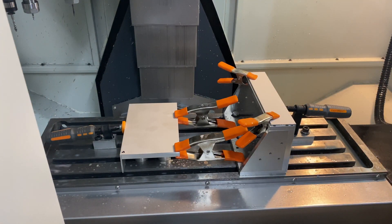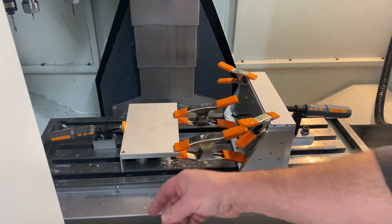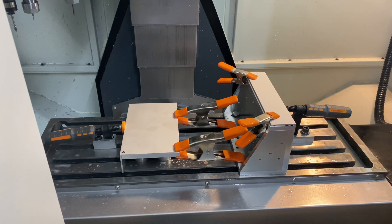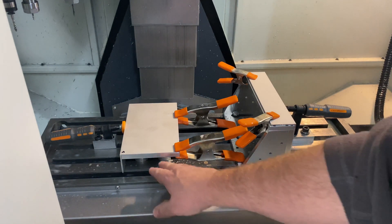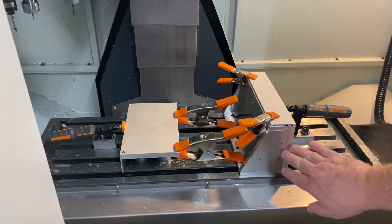I've repositioned the camera and brought you over to the CNC machine. You can see that I've manually machined these standoffs on the manual lathe — basic sort of turning work: facing, center drilling, drilling, and machine tapping, commonly referred to as rigid tapping, to make this fixture plate. Then I used the CNC machine to make this right angle fixture plate.